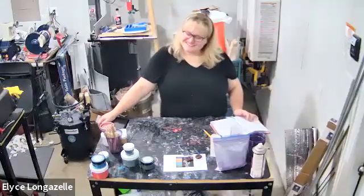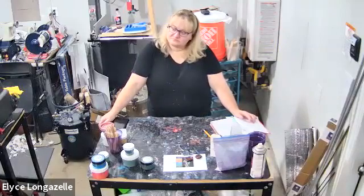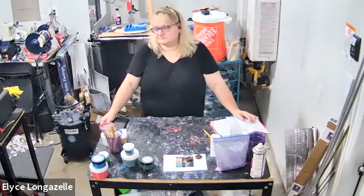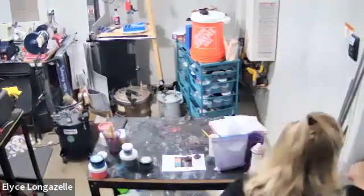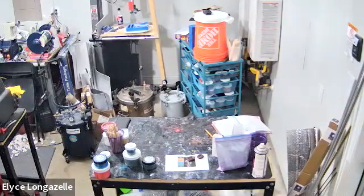Okay. So for high volume shops, they'll likely use a different resin. They'll use a polyester based resin or an acrylic acetate, which lends itself to injection molding and automated processes. A lot of the resins used by, say, Edison, their stock lines are all acrylic acetate. And the injection molding is computer controlled so that the blanks are identical across the board. And they do a really good job that way. But it's a much different product than what the artisan makers use and come up with.